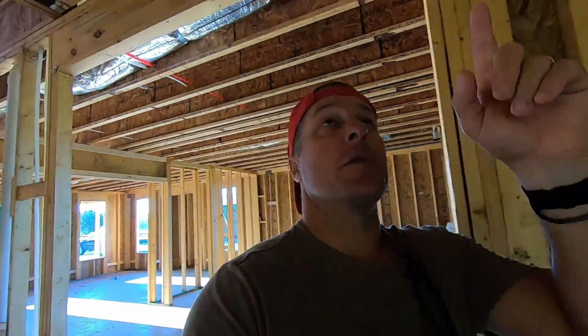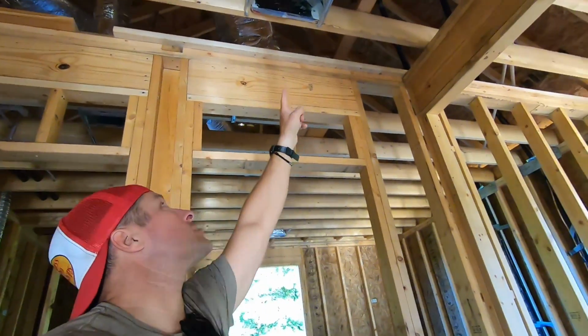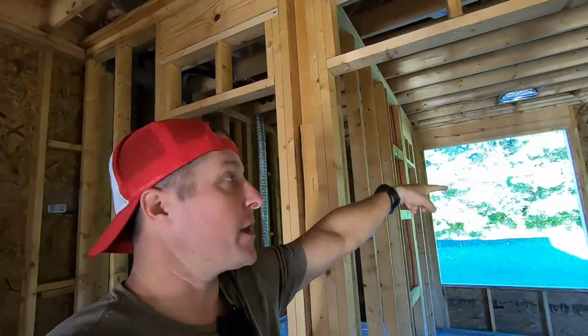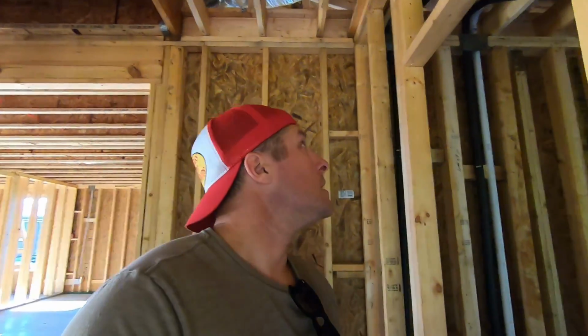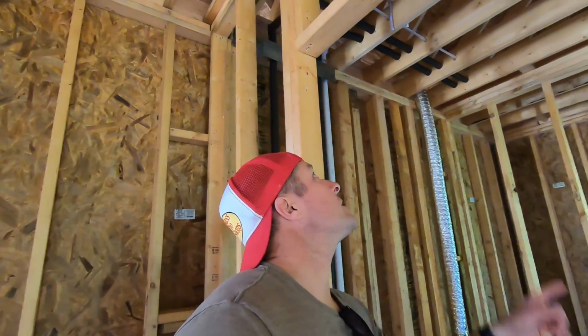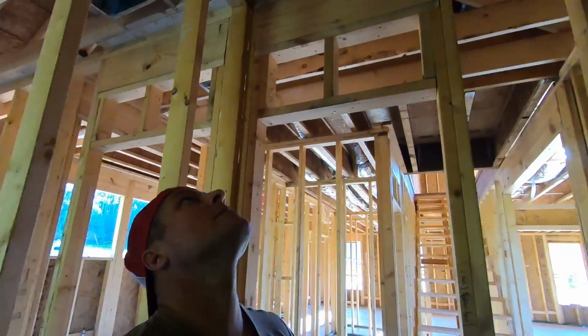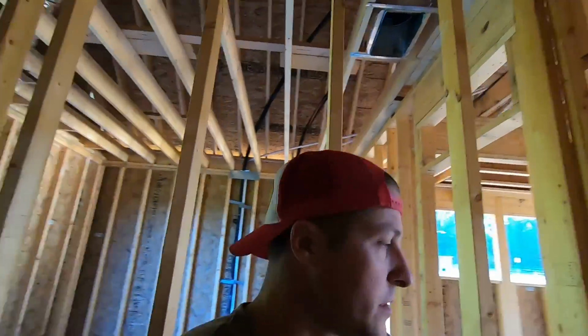And then if we go over to the other side of the house on the main floor, since this system is just on this floor, you have another return. Actually, there's 2 returns right here. There's 1 return in the hallway, and there's 1 return in the bedroom. And then as far as registers or vents, we have, see, there's 1 in the bathroom. That looks like a 4-inch maybe. So 4-inch overhead in the bathroom.